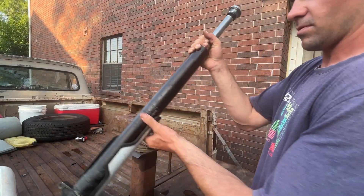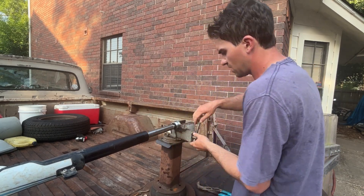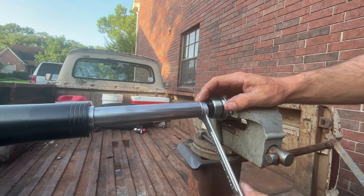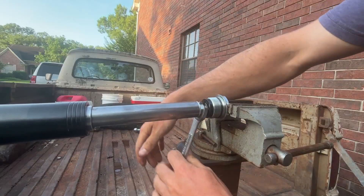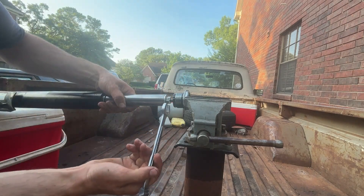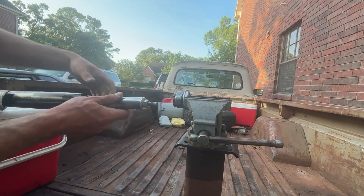I'm going to put the cap in the vise — it's aluminum, so hold it tight but don't break it. We've got our cap in the vise and our nut here. Basically, you're just trying to work this thing back and forth a little bit. There is some Loctite, so be patient — you'll feel it get kind of stiff. There we go, just broke free of that stiffness. Once all the threads run out, the cap will no longer be connected, so make sure you have a hold on it or something to catch it.